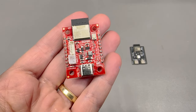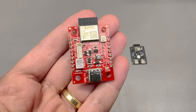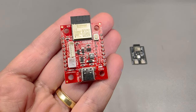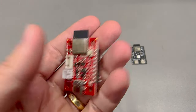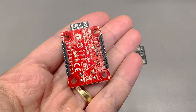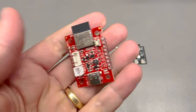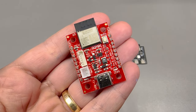It's a very basic ESP32C3 dev module but has all of the required basic stuff that I like: it's got USB-C, some status LEDs, a single cell LiPo charging circuit, and the GPIO broken out to a 0.1 inch header. It sells for 6 euros, which is not bad considering it's made in the EU, and it comes with great documentation.